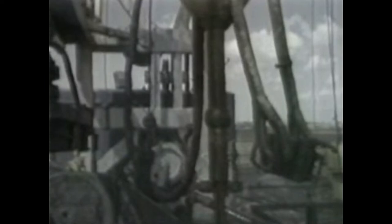The idea behind rotary drilling is that a drill bit is rotated into the earth to crumble up the rock and make a hole. The next essential component of the drilling rig is the rotating equipment — those pieces that actually turn the drill pipe and rotate the bit at the bottom of the hole. These are the pieces from the swivel down to the drill bit. The swivel is attached to the hook and allows the drill string to rotate, and also performs another very important function as part of the fluid circulation system.